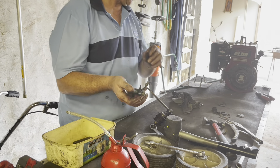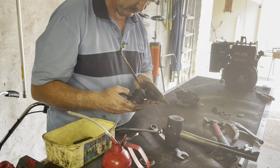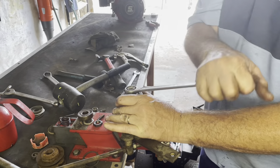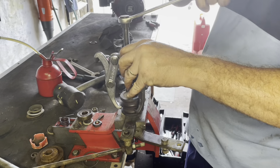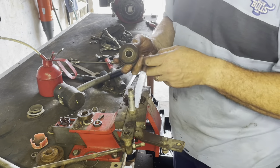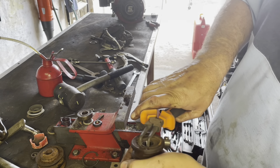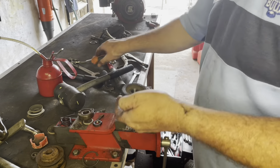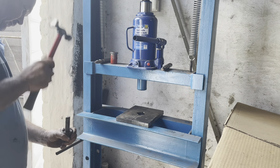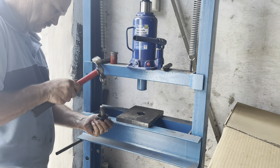The mounting brackets were removed. Taking a quick look at the pulley — take off the nut, then use the puller again to grab the pulley out. There's an internal circlip again, and on the inside there are two bearings. Just be careful when you knock it — there's an internal circlip on the inside as well.